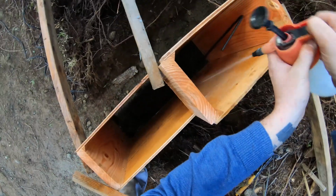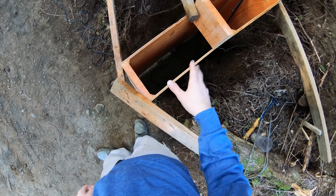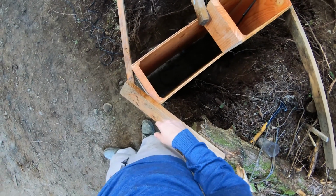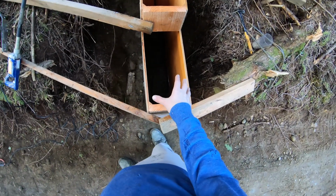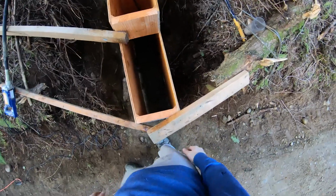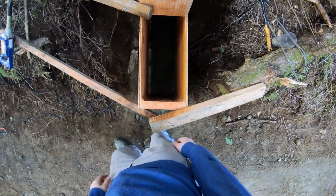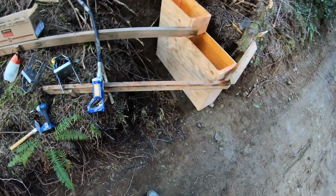Anyways, rant over. Now I'm just gonna wheel it over, and I've got a little bin, and I'll dump it in the bin. I did the math, and it should be around 14 bags of concrete, something like that. It's basically around 7 cubic feet, if you measure by volume. And each 60-pound bag is roughly half a cubic foot, so roughly 14. It's always a little more, though, because it's going to bulge out a little. But I got plenty. All right, let's get this over with.